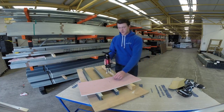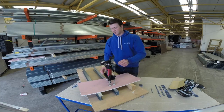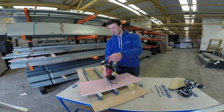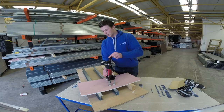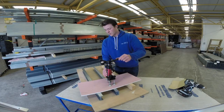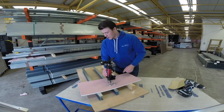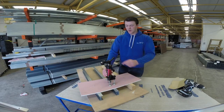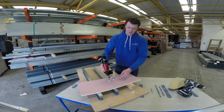We'll now try the metal C-stud, which is the alternative to this timber. By resetting the gauge to nought we will then begin to wind the handle once again. The gauge is rising up and it is now past the strength of the timber and still holding. The fixing has just failed at one kilonewton, which is 100kg — 100kg can be hung on this to make the fixing fail.